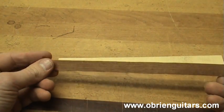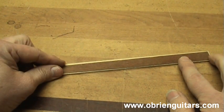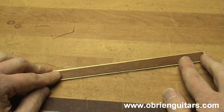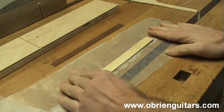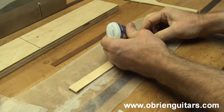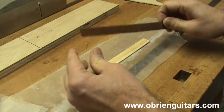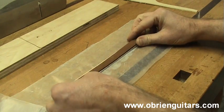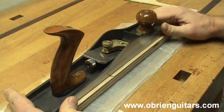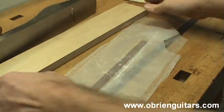I'm going to take this thin piece of mahogany veneer and just glue it to the spruce like this. When I glue this, I don't want to introduce any moisture, therefore I'm going to use CA glue or epoxy. You also want to do this step when you have a fairly constant relative humidity level in your shop. I'll place a little wax paper on my bench to protect it, apply a little medium viscosity CA glue on the strip, place the veneer over the top, put another piece of wax paper over that, and put a little weight on it as it dries. Since it's CA glue, it shouldn't take very long.